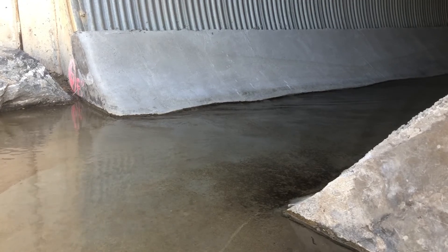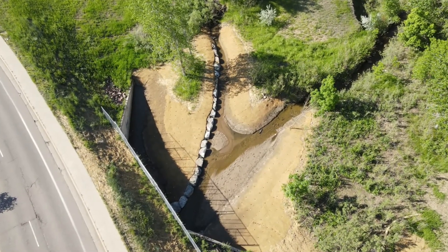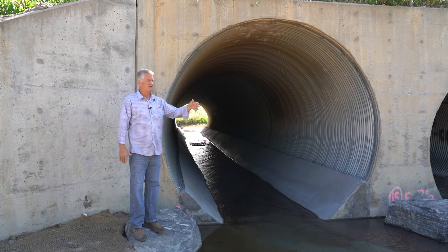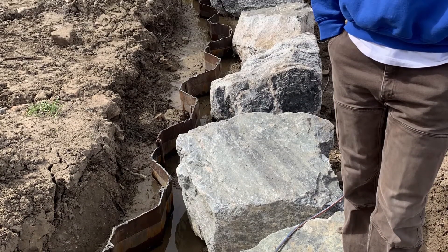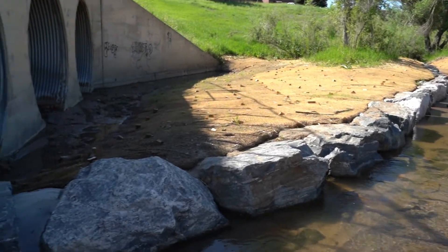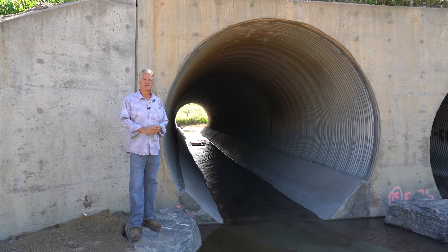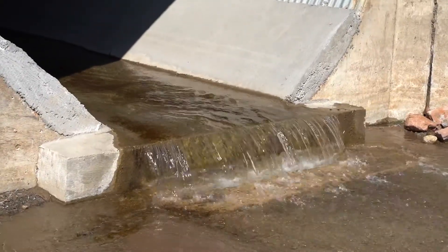The purpose of the boulder edging is to define the creek so that it works its way towards and into the culvert and keeps the sediment load moving through this section. What you see here is only two-thirds of the boulder — a third of it's buried — and then there's a five-foot sheet pile PZ22 driven below that, all grouted in mass, making a very good edge to contain the flows. In a storm event the water will come up, go over the boulders, and enter the three other culverts which are to take the storm flows. As a maintenance project for the district, this is the type of project we really enjoy doing. It's increased the life of the bridge, water quality is improved in Willow Creek dramatically from keeping all the pollutants out of the water. It's been a really successful project for us.